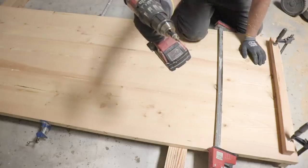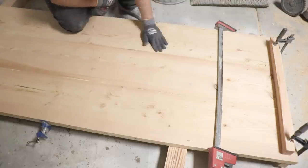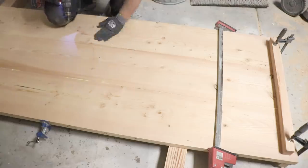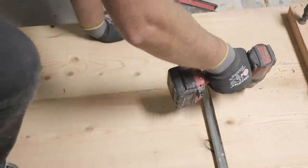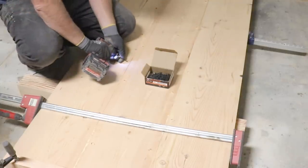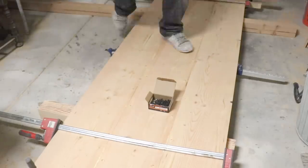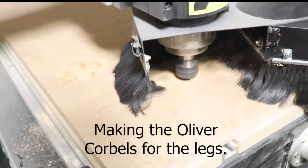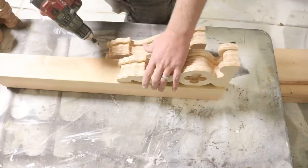While this is gluing up, I've got my 3/8 countersink bit in my drill. I'm going to go ahead and put some screws in here for some added strength. I'm starting my hole about an inch away from the edge of the board and I'll use an inch and 5/8 screw in here. I'm going at about a 45 degree angle. You can see my holes on this side of the board. Now I'm going to come about right in between on this side and run some more countersinks. I put the screws in while it's still clamped up, so when I take the clamps off everything should stay nice and tight.